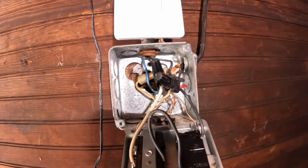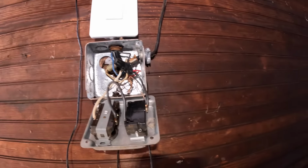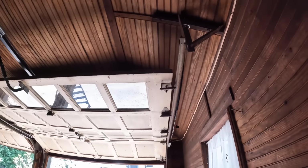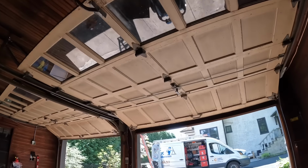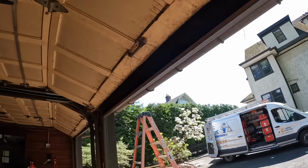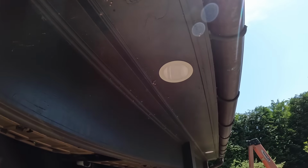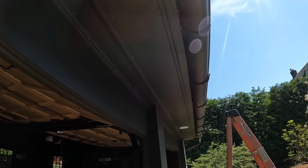We're going to disconnect the wire coming from the back, and we'll come into the top with a piece of conduit. I'll fix all this stuff up since this is controlling a couple of down lights in the soffit out here, which they definitely didn't have LED in 1909 when this house was wired.